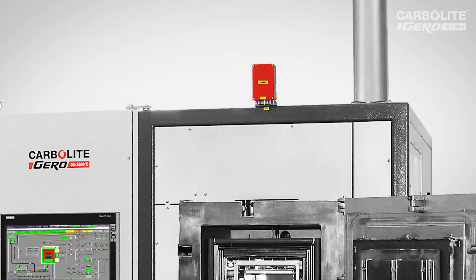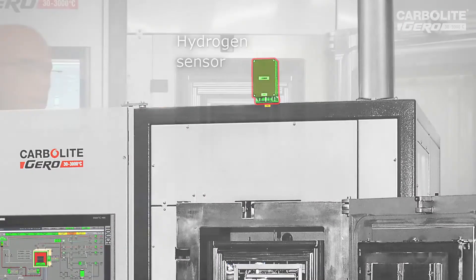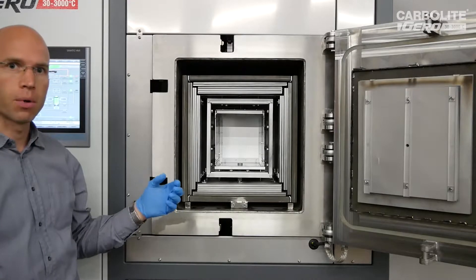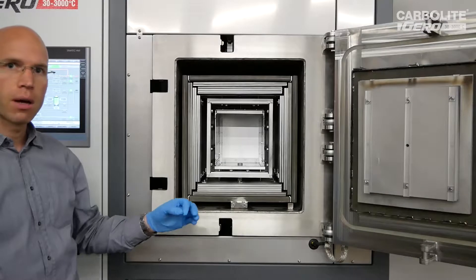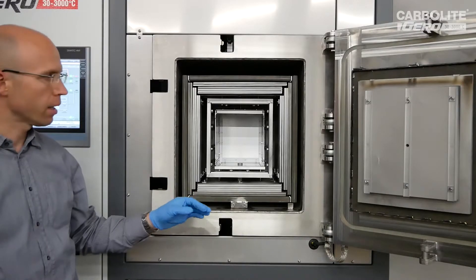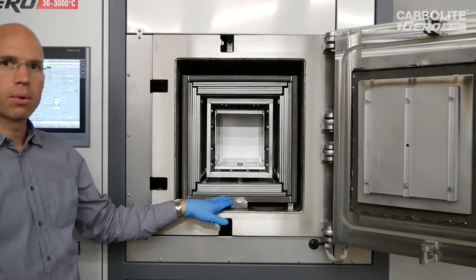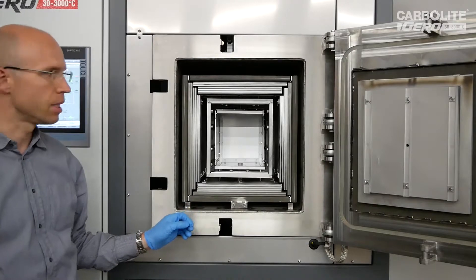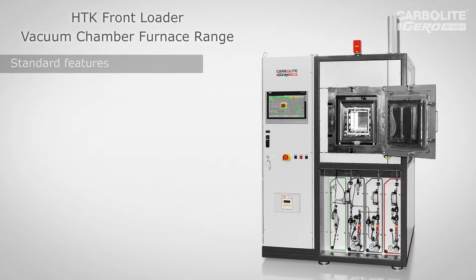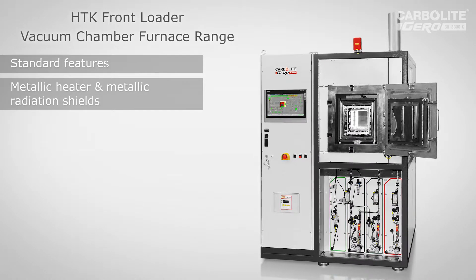On top there is the hydrogen sensor, because during sintering the furnace is tailored for hydrogen operation under overpressure. At the beginning you get rid of the air by pumping down, then purge back, and then you can start hydrogen operation beginning from room temperature up to 1600 degrees C at most. This was the fully automatic HDK 8 molybdenum furnace equipped for debinding and sintering, explained in detail.